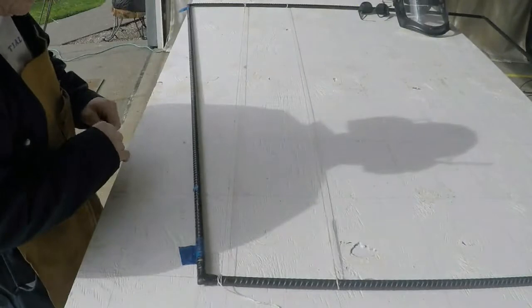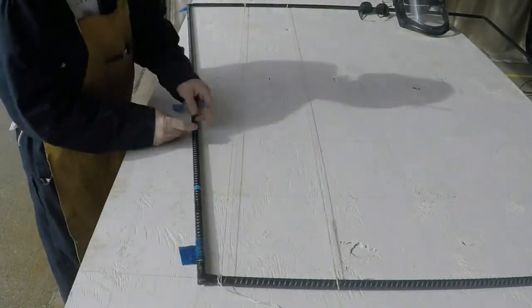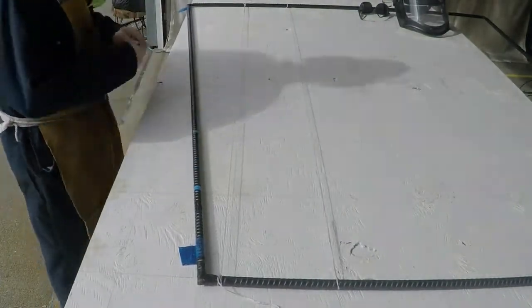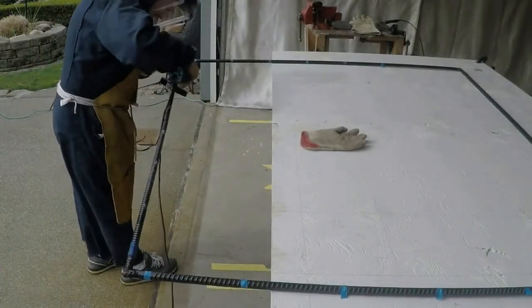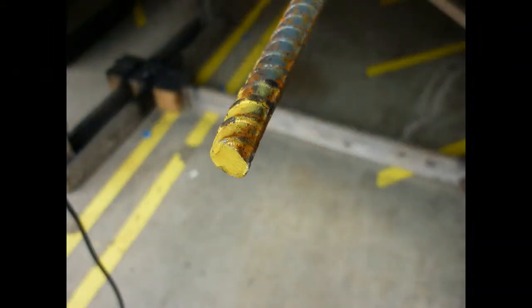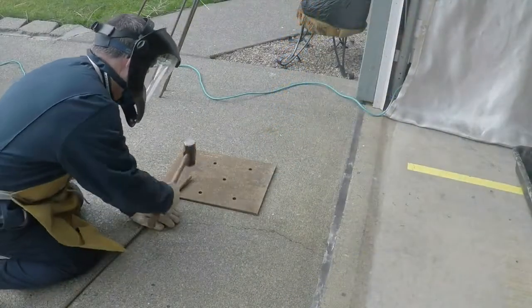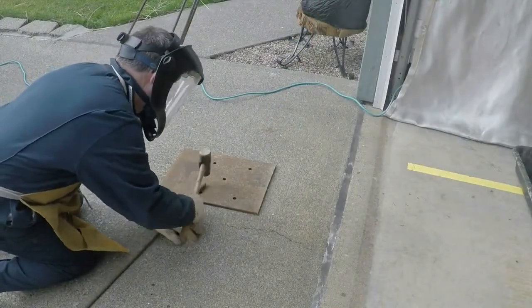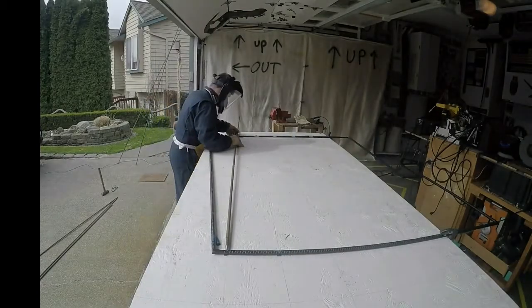The frames were painted black to protect them from the weather. Before we weld any rebar on the inside of the frame, mark where the rebar is going to go, then take your grinder and clean all that paint and rust off for at least an inch past each of your welds. Now, the rebar that you brought home is going to be in pretty poor shape on the ends — it'll either be painted or bent because of their manufacturing cutting process. Take a small sledgehammer, rolling the rebar, and hit it to try to straighten that bend out. Lay it on the frame and mark where you're going to cut it.